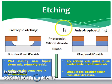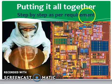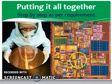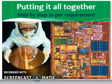So by using these five steps, we draw and pattern one particular active or one particular passive component on a chip — on silicon — or maybe a combination of active and passive components that makes a chip. And finally, putting it all together step by step as per our requirement, we can fabricate many transistors, many resistors and their interconnections in one chip. And that one chip is then cut into small pieces and molded into a particular shape — that is called an integrated IC.